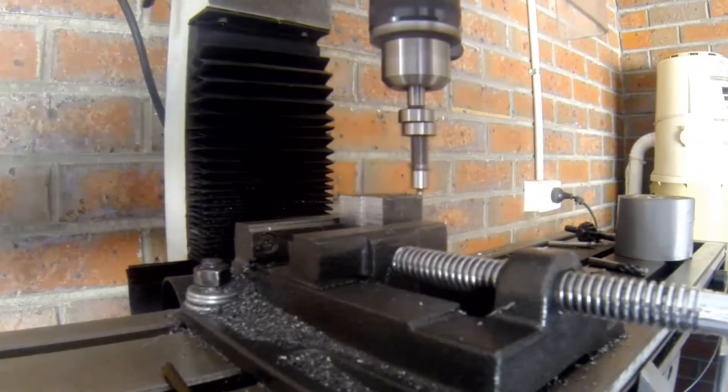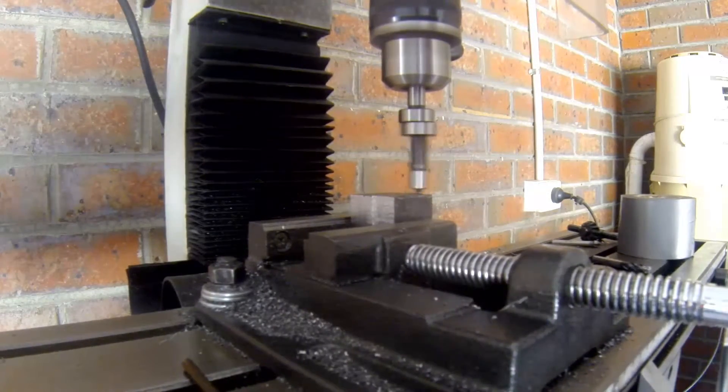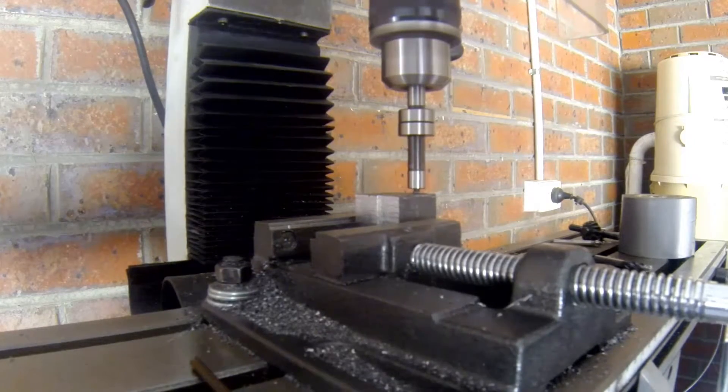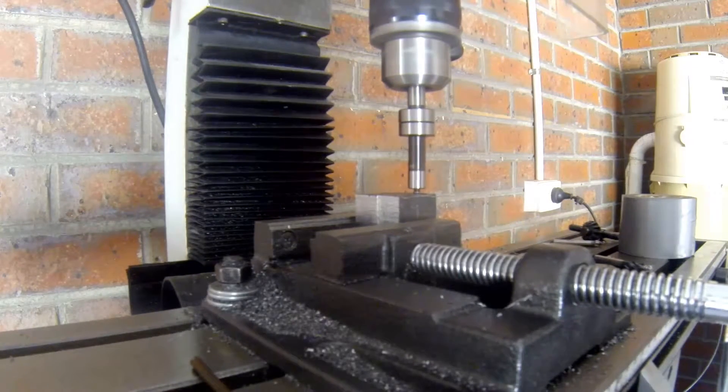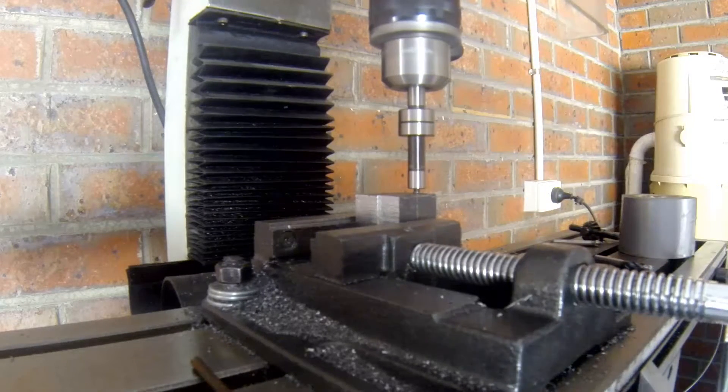So let's technically find this edge. Now that's the edge there — I'm happy with that. It stopped wobbling. You might see the reflection in the edge finder there — it's staying pretty straight. But it is cheap Chinese, and within half a mil I'm happy.